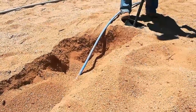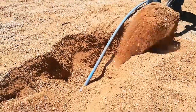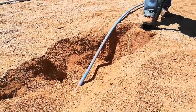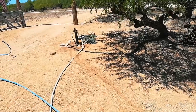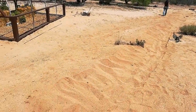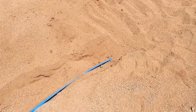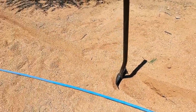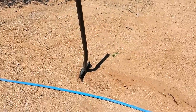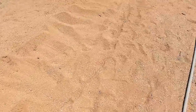Here's the problem — you dig the ditch and the sand keeps falling right back in. If you look closely at the sides, as we dig, the sand just keeps refilling the trench. So all we can do is go three or four feet and then quickly bury the pipe and get back to digging. We've done about 60 feet this morning — it's taking maybe 45 minutes to an hour. It's just slow going because you've got to develop a technique. Yvonne digs the trench to establish the route, then I get into the trench from behind and dig like a dog. Then we put the PEX in and cover it as we go.